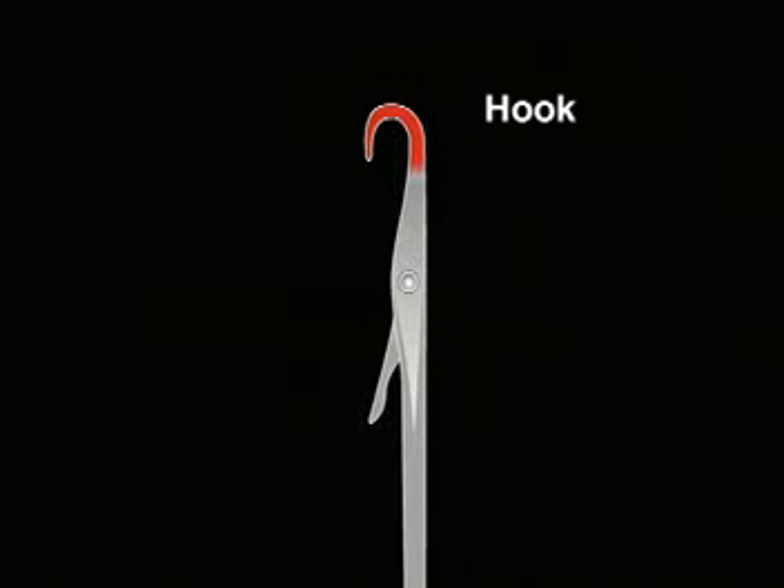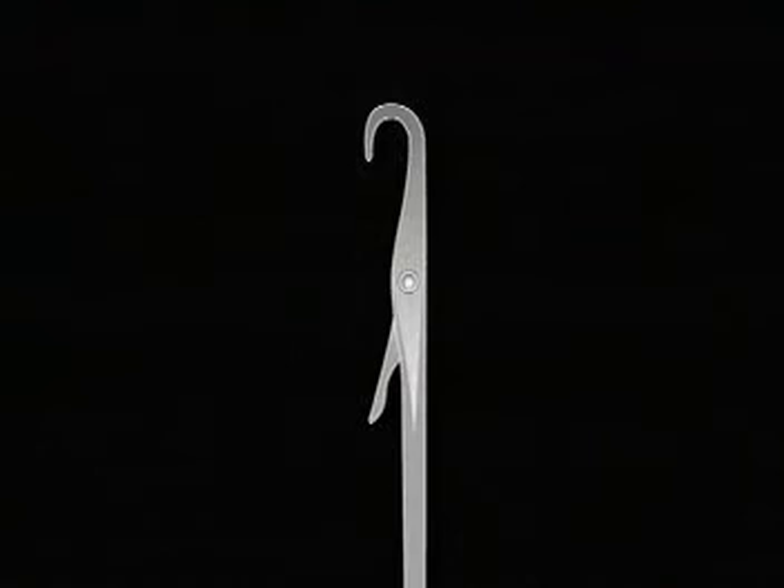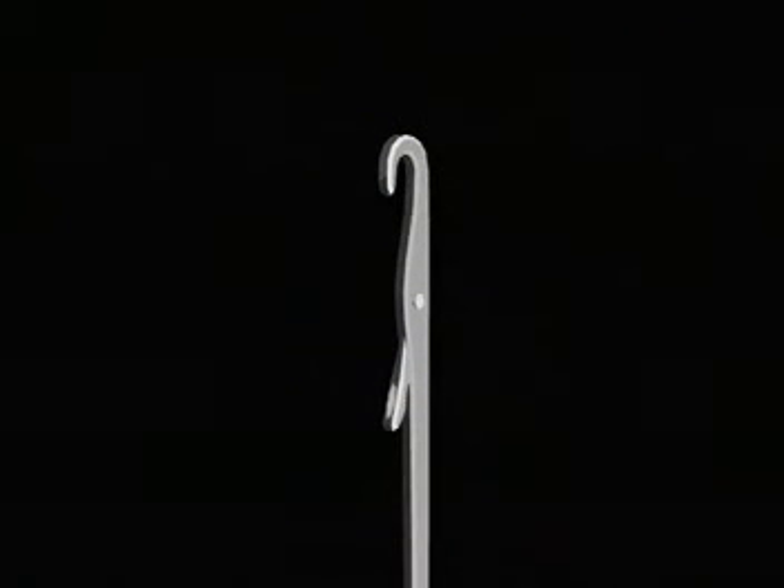Now let's take a closer look at the needle itself and label its parts. At the top of each needle is a hook. Below this is a latch, attached with a rivet. The bottom edge, or cup, of the latch is curved to fit over and completely close the hook. At the bottom of the needle is a butt, which plays a part in controlling how needles activate up or down. A needle with a latch is very efficient — when latch needles are used to create weft knits, the knitting cycle can be completed without any auxiliary attachments.